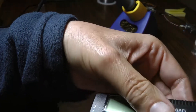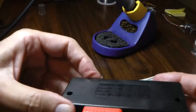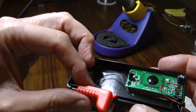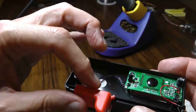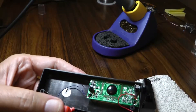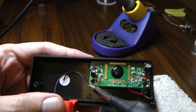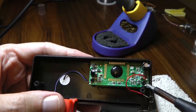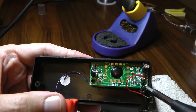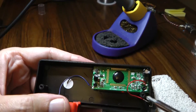So I took the tester apart. There are just two Phillips screws in the back that you take out. The back comes off very easily, and this has to stay connected because of the blue wire going to the circuit board. There's plenty of room in here where we can solder a resistor to the negative and to the positive of the battery.